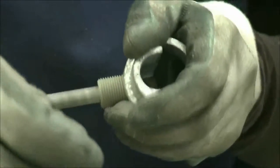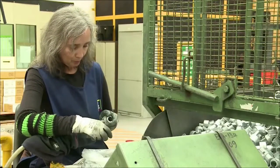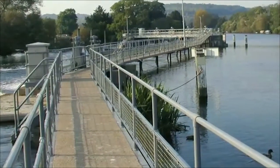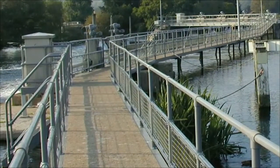The average life of a structure using corrosion-resistant hot-dip galvanized key clamp fittings will be 37 years in a category three town such as Newcastle upon Tyne. This compares very favorably to the 4.7-year lifespan of a fabricated untreated steel structure. Key clamp fittings do away with the need for any bending or welding of tube on site — it simply just needs to be cut to size. This dramatically reduces labor costs, resulting in added long-term value to the client.